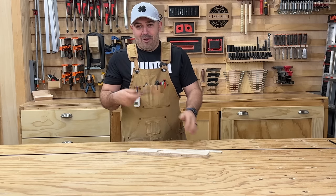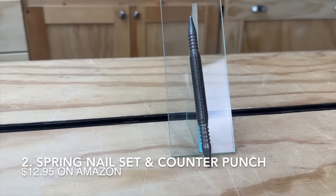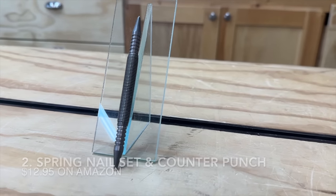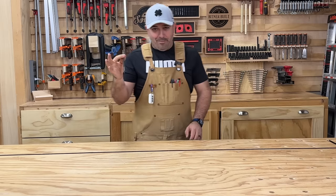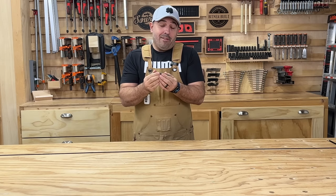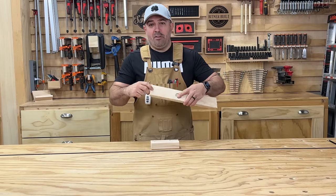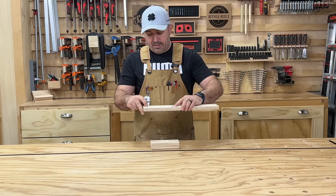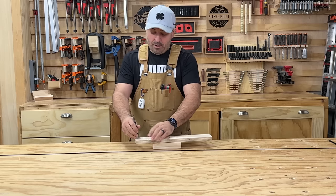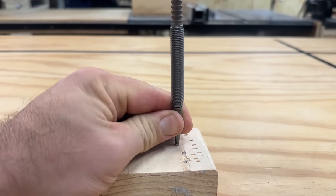Number two always lives on my apron — I use it every single day. It is a spring nail set and counter punch, $12.95 on Amazon. It's also a fun tool to just shake around and make this boingy action. But the real use is to replace a nail punch or nail set — it's two tools in one. If I grab a piece of wood and a nail is proud — not flush or recessed — I take this on the flat side, put it against the nail, pull directly up, and let go, and it strikes and drives the nail all the way down.